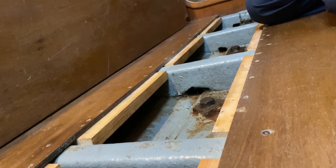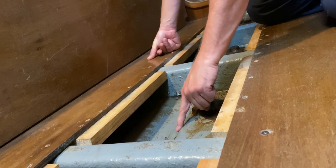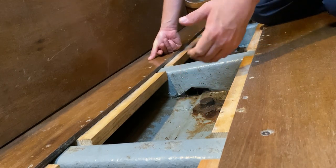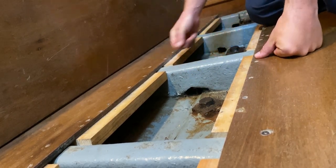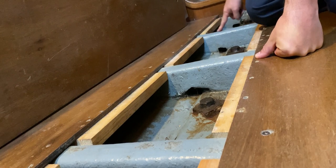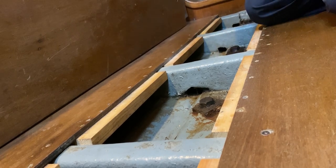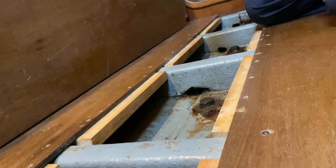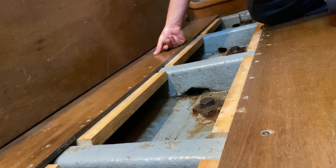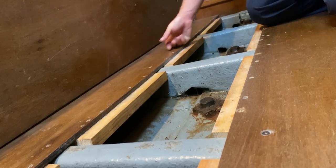The only other features to mention: the centreline here looks a lot thicker — there's a ridge — and it is thicker because it's designed to take the weight of the keel underneath the boat. Also we've got these thwart-ship strengtheners or frames, which run throughout the boat wherever the designer has placed them, serving to strengthen the ship in a thwart-ships direction and, where they run up the sides, to strengthen the sides as well. This has been Tim from Boatshare Yacht Brokers taking you through a very basic bilge setup — what it's for, what's in it, and why we should keep it nice and clean. Thanks for watching, we'll see you next time.